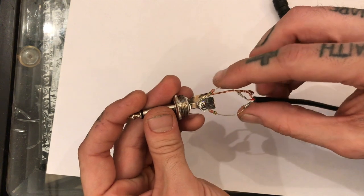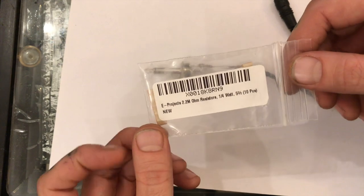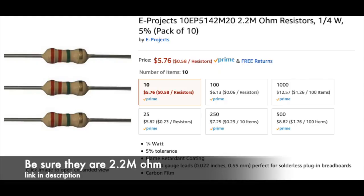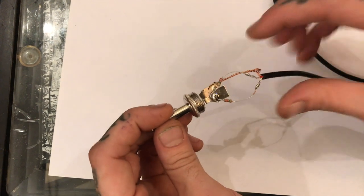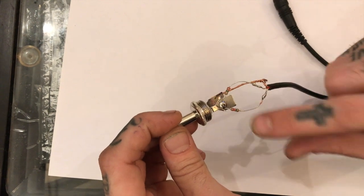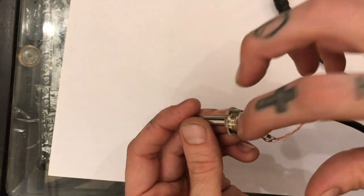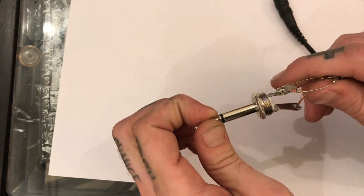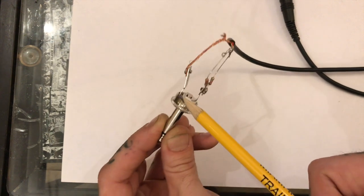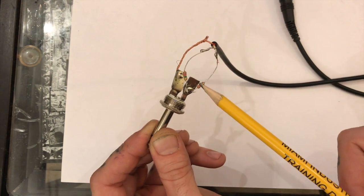These resistors are the other important part — 2.2 mega ohm resistors. This is the pack that I got them in; I'll put a link. You'll take the resistors, one resistor for each channel of your left and right, and then they get bridged down to the tip of your mono plug. So the tip goes to my signal wires — my left and right — which are each run through a resistor to the signal.